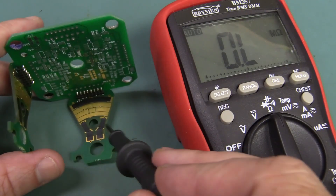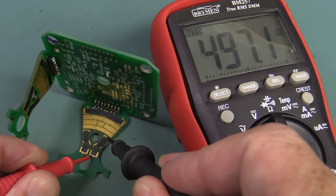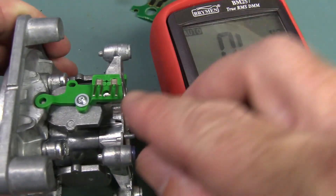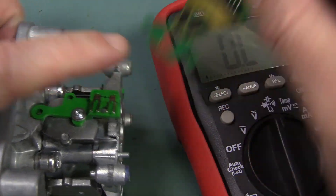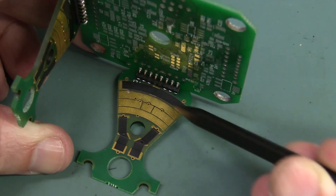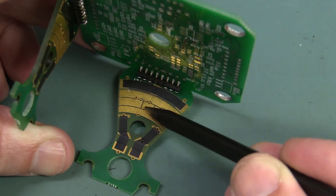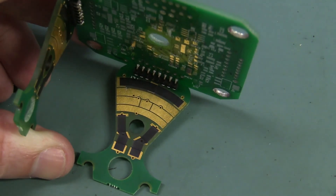And we've got another one across here which is a different axis, but this doesn't look like it's used at all on this particular joystick with the contacts anyway. That one's around about 500 ohms a piece. It looks like we've got two contacts there and two contacts there, so maybe they had something else there for these top contacts, but these aren't used in this particular model. So you've got one wiper across there and there — that'll be a regular potentiometer going back and forth with your center tap, and the other one detects whether or not it's at center.